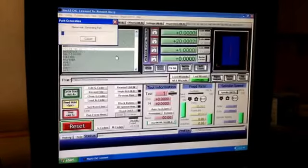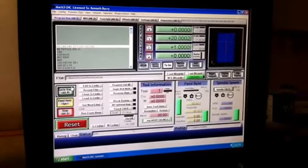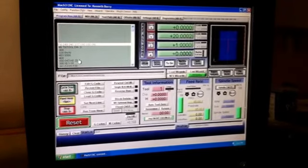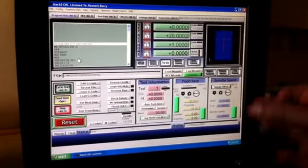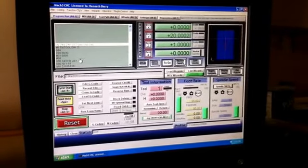And now when it comes up, it'll have generated the G code, and if my machine has been set to 0,0, then I can simply press start, and it will start to run this code, and it'll begin surfacing the table. In this scenario, it'll go down 1/10 of an inch total at 50 thousandths per pass, 60% step over using a 2-inch tool, and that step over would be 60% of 2 inches. And so if you use a 1-inch tool or a 5-inch tool or whatever, it'll always be 60% of it.